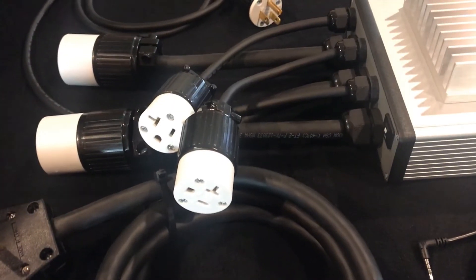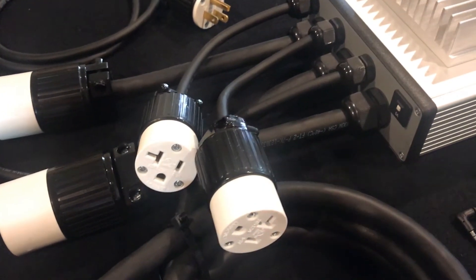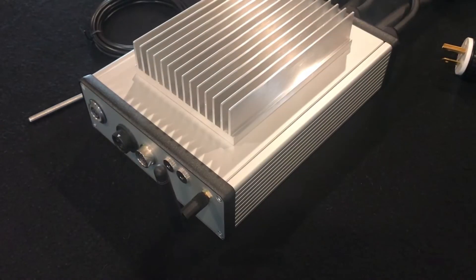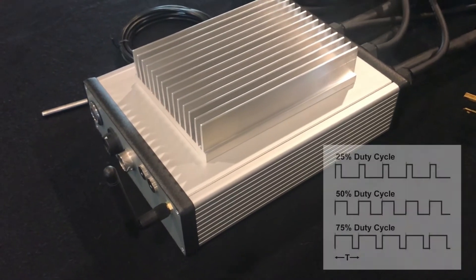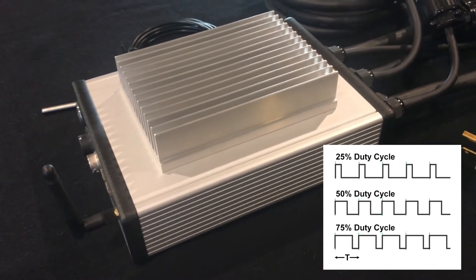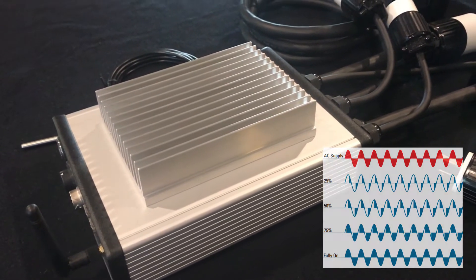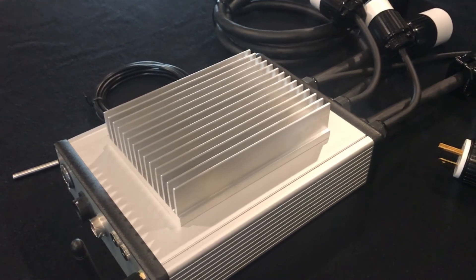Next is single or dual accessory power. Use these 120 volt power outputs to control pumps or other devices such as a valve to fill your vessels or control flush water. Next is a standard binary or optional proportional solid state relay. The binary SSR turns on and off every few seconds to deliver a total average power, whereas the proportional control SSR delivers a consistently modulated amount of power which can reduce heat cycling and the pulsing often seen from heating elements.